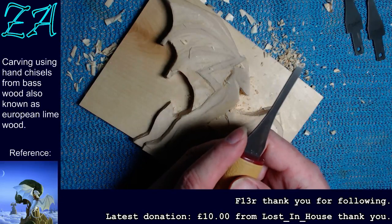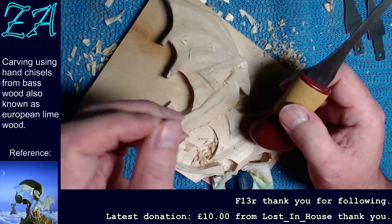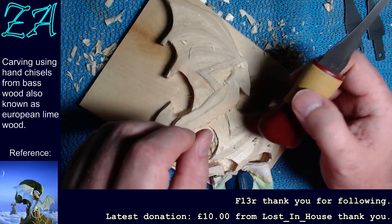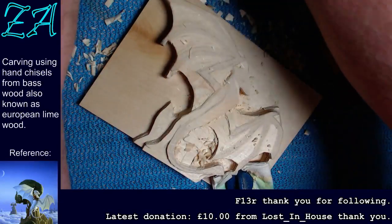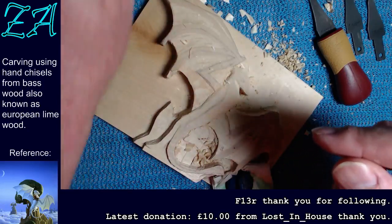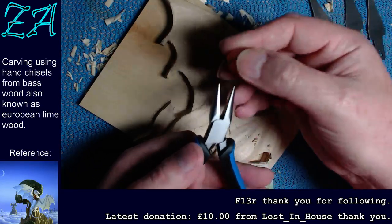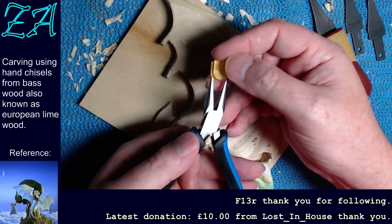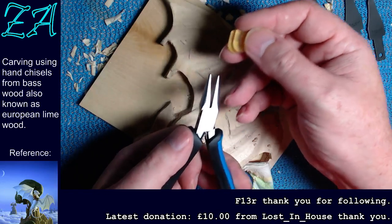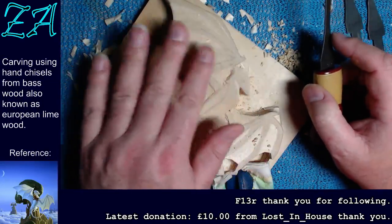And I'm not quite sure how the nylon tips would do, because I'm not sure how they'd hold, since nylon is also quite slippy. If the nylon tips were on parallel jaws, it wouldn't be so bad, I don't think. But on this sort of jaw, because you're holding a round object, nylon is quite slippy, so it would have a tendency to push it away. I don't know. I was just thinking of it from the point of view of not scratching things.